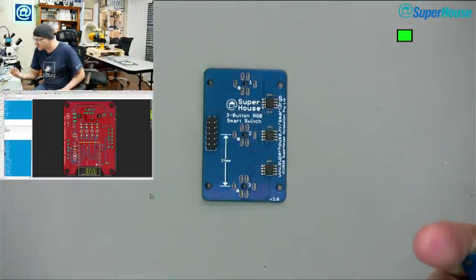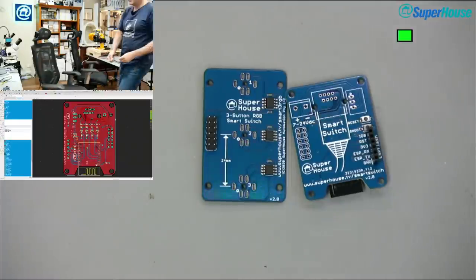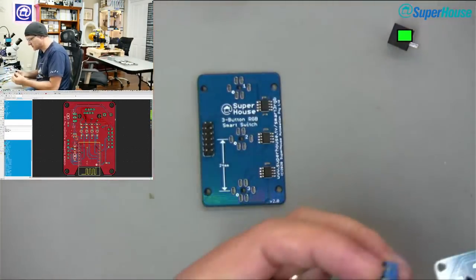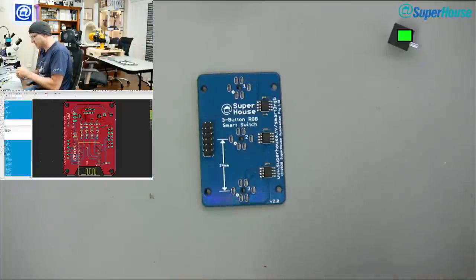I need to put on a 5-volt regulator and an 8P8C socket. Here's a K7805 — I really like these little regulators. The K series are like the L78 series except that they are switch mode. Here are some 8P8C sockets, and I need a 5mm screw terminal — might be 3.5mm pitch, I can't remember what I used on this one. As I was doing this I got some feedback — on my original layout you can see the screw terminals coming in sideways, so if you are supplying power directly on the board and not using power over the 8P8C cable, you can just supply power directly there and the cable comes in from the side.